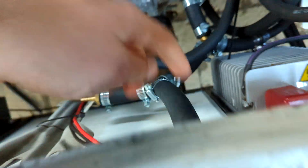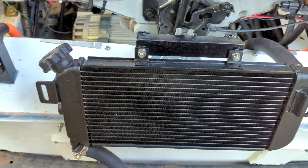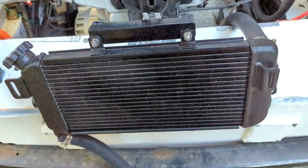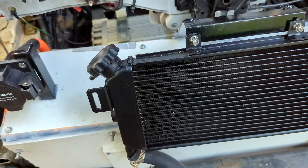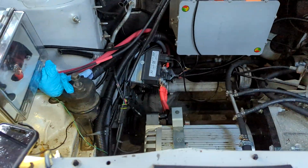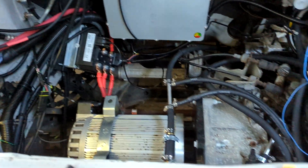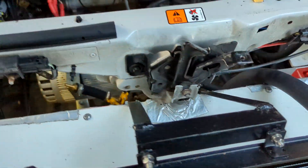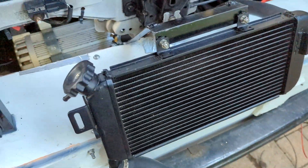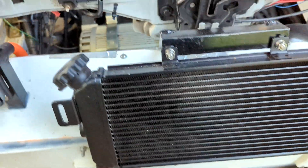This return is going to flow up into the radiator. This is a motorcycle radiator — I believe it's Kawasaki. I got it on eBay for about 70 bucks. I got it because it has a reservoir as well, which simplifies things. You're not going to need a whole bunch of cooling with this. I've seen people run the SME inverter without any cooling at all — the chill plate is optional. The Tesla batteries under the kind of discharge you can do with a Hyper 9 shouldn't be struggling too much. Also no fast charging, just 6.6 kilowatts, so I don't think I'll need a ton of cooling capacity. Right now I don't have a fan on it; I'll see how that works out and might add one later.